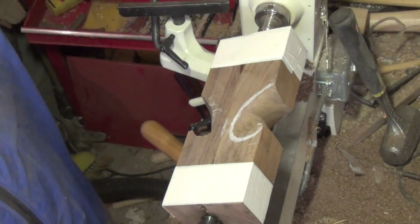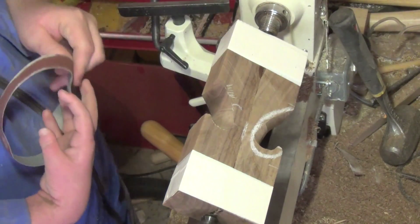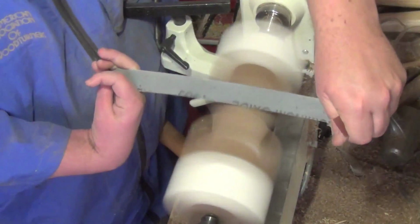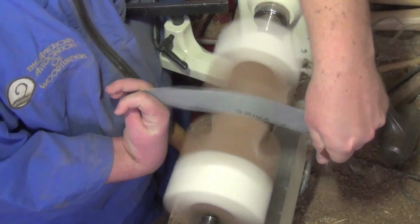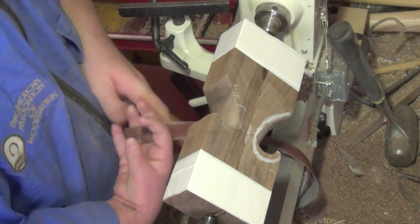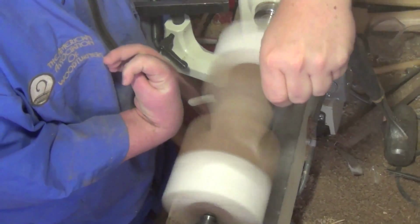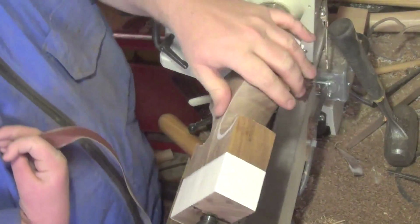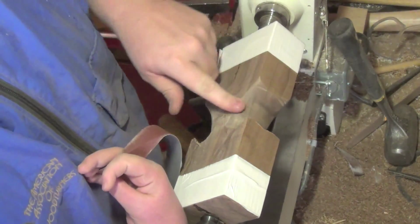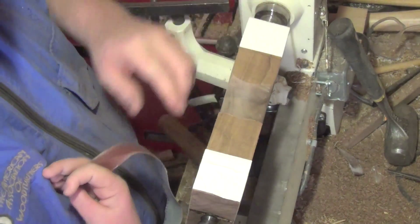And whatever you do in one direction, you've got to do in the other direction when it comes to sanding. Otherwise, sand the dang thing by hand. So if you don't have reverse, sand it by hand. Forward and backwards, same amount, because what that does, that curves over these edges. So whatever you do one way, you've got to do the other way.